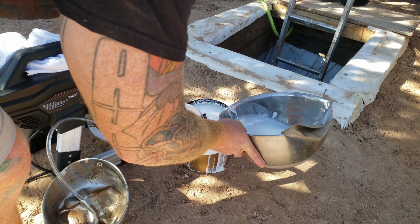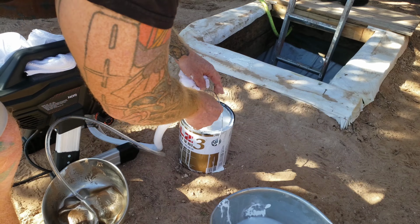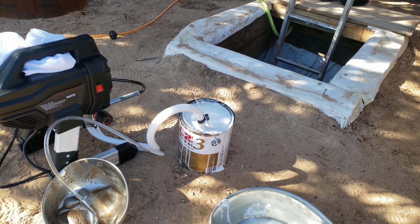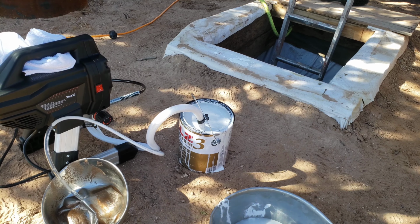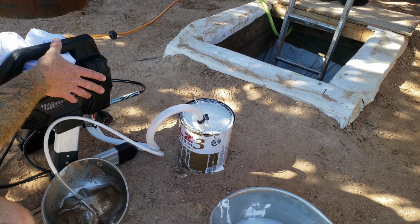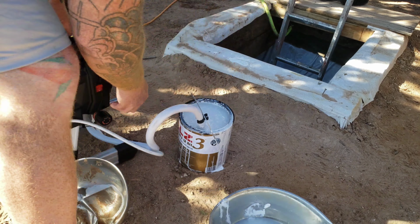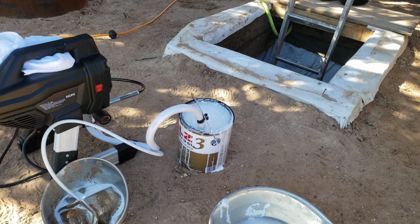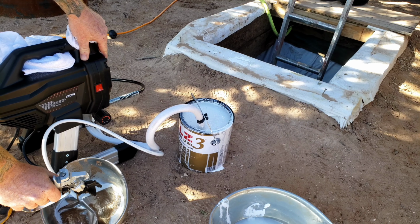For my next cistern, which is ready to go in any time now, I'm going to line the hole, stretch a tarp across the top, cover that with logs, and then cover that with another tarp, and that'll keep everything separate. It'll work better and more efficiently immediately, but this should work just fine. I just had to drain it once and then go down there and put in a cistern paint to cover all that wood.